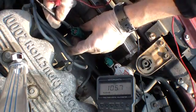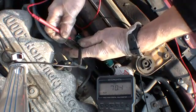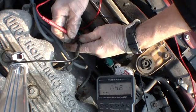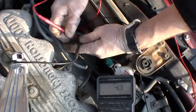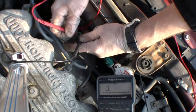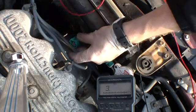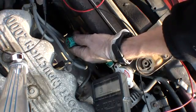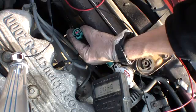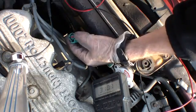This is negative, and we're going to feel around in these pins for the positive — what we're looking for is 12 volts or something like that. That's our guy. So I've labeled these. The only two that are left are the signal and return lines. One of them is a signal, one of them is a return, and you're just measuring voltage off of these, so it's not really going to matter which one you get into as long as you get into the right ones.